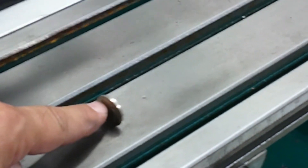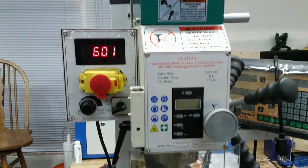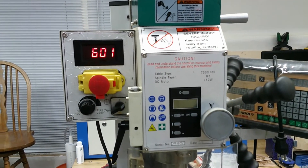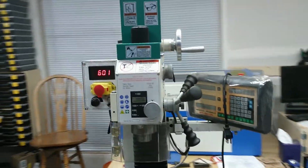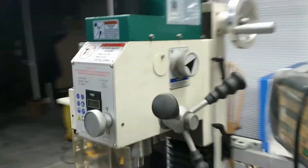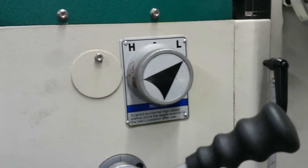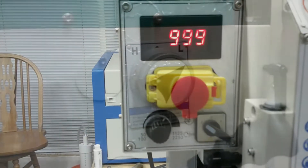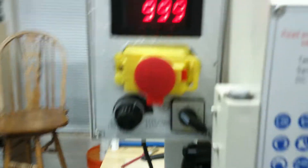When the 10 minutes has elapsed, stop the mill. Set the speed range selector knob in the H high position. Place the spindle direction selection knob in the forward position. Rotate the variable speed knob all the way to the left slowest position. Open the emergency stop button cover and press the green button to start the spindle. Slowly rotate the variable speed knob to the right until the speed is approximately 1000 RPM on the display and run the mill in forward at this speed for 5 minutes.